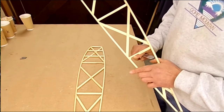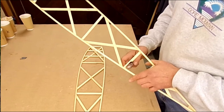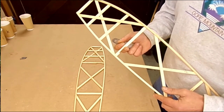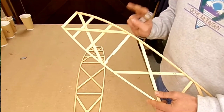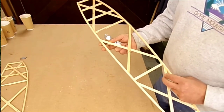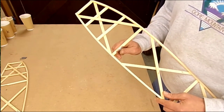So I've just made that wider than the strap by a section and deeper, so it's about 3/16 to allow for the 1/8 inch there. And then at the front here, it's been dressed back. So this is the lower root rib. The upper root rib is similarly dressed out here for the tang to go through.